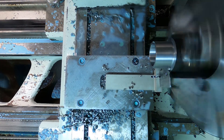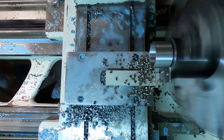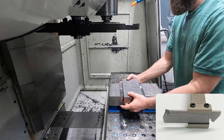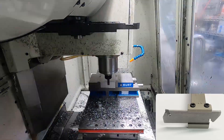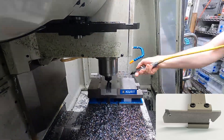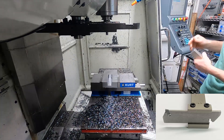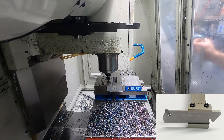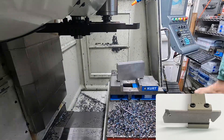I like y-axis parting, and I also like the idea of having a dedicated part-off tool on the other side of my ProtoTrack's cross slide. My ProtoTrack doesn't have a y-axis, it only has an x-axis. But I was thinking there would be an interesting way to hold a y-axis part-off tool, and that would achieve two things for me: it would be a smaller use of space for the part-off tooling, allowing me to have more use of my cross slide, and it would also give me a y-axis part-off tool, which I thought would be pretty cool to try out.